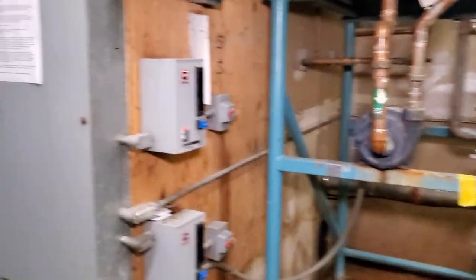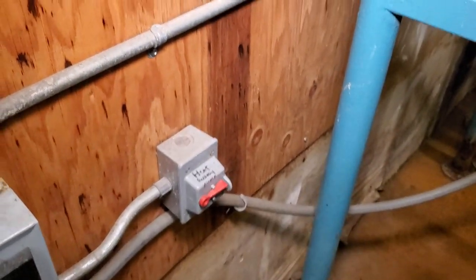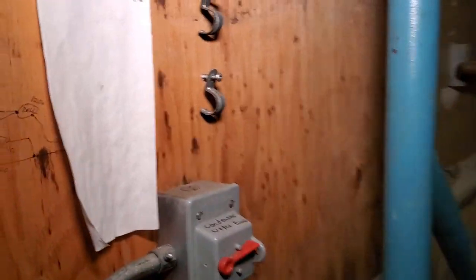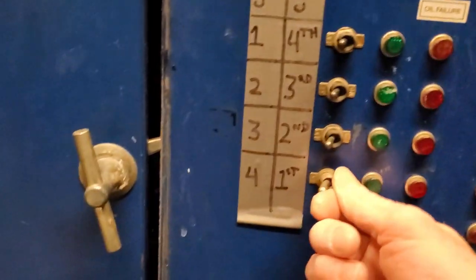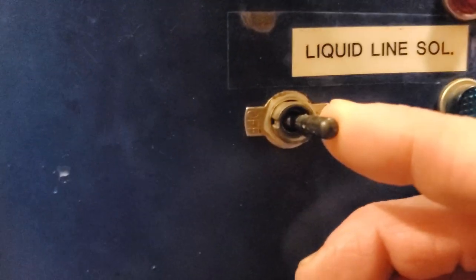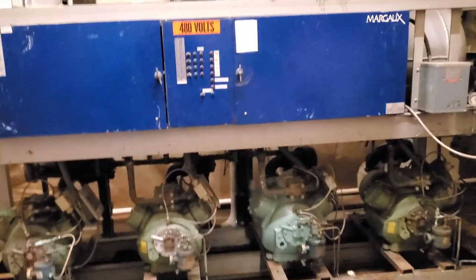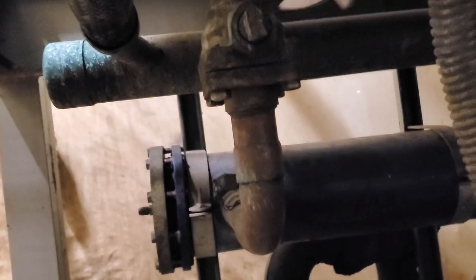Got the condenser water pump still going. I could turn the fans off because those are not going to kick on. Heat recovery — I'm going to leave that on just for a minute until the compressors turn off. I'll turn one fan on just in case while we're pumping. Let's go ahead and pump down the system. We'll turn on CPU stage number one right here. Make sure this liquid-line solenoid is off and it'll probably take like ten minutes to pump her down. It took about five minutes. It's this valve right here — I just need to turn this thing closed.